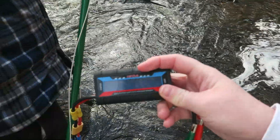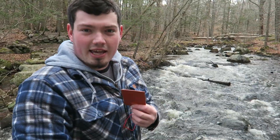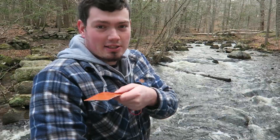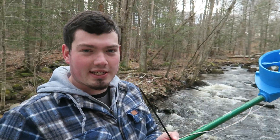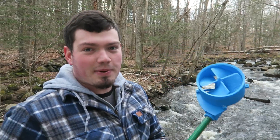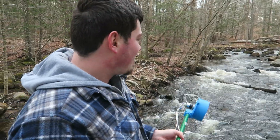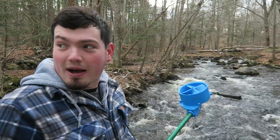I can't get it to focus on it. Did it show it at all? It won't focus on it — if you stop the video and then restart it, it should focus. So now that we got the test, we're consistently getting readings. I switched it to the 550 RPM motor and it didn't do a very good job, so we switched back to the 1000 RPM. With this hooked up, it takes so much resistance to spin that it's not spinning fast enough to register on the power analyzer. I might try to walk to a spot where there's faster flowing water so it actually will.